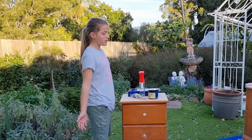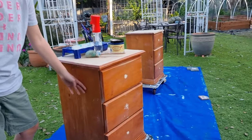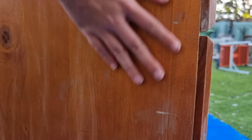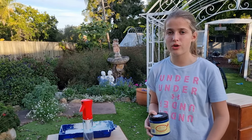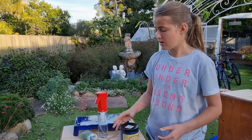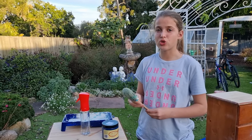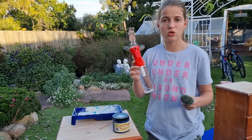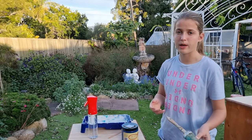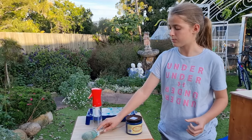Okay guys, so we did our preparations. We used Dixie Belle mud to cover up the scratches and scuff sanded with the 120 to make our Dixie Belle mud nice and smooth. I'll be using Dixie Belle Bunker Hill Blue chalk paint. With this paint I won't have to do an undercoat, but when I finish painting I will have to put wax over it. I've got an Annie Sloan chalk paintbrush which I sprayed some mister on, and I put a bit of water on my paintbrush so the paint goes on smoother. Okay, let's begin.